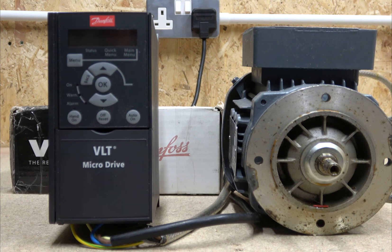Usually when you buy these drives the front keypad comes in two types, and the drive usually comes without one. This one has a keypad and is for sale with one. There's one with a potentiometer and one without. We're going to be running this in a minute in local mode to see how it runs and how it reacts to the motor. I'm using a 13-amp plug because I'm not putting any load on the drive — this is just for testing purposes.